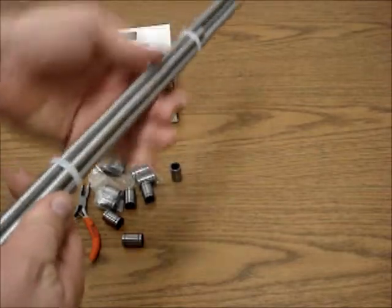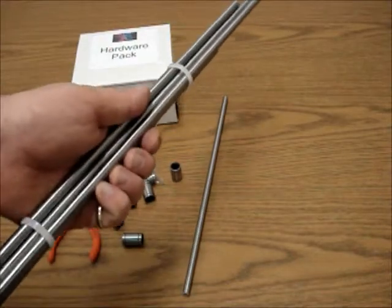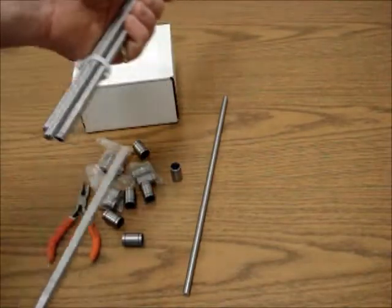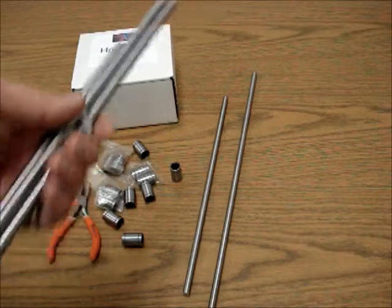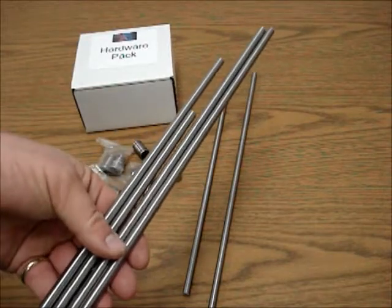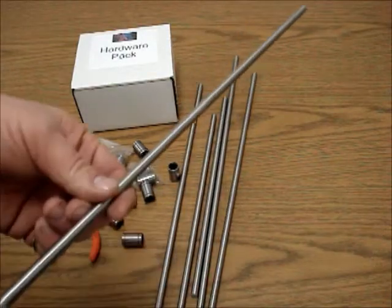We're going to slide these out and take each of the smooth rods. You can actually kind of hear them — they kind of sound a little bit like sandpaper as you're moving them out. Even though they call them smooth rods, I like what's called drill rod. Drill rod is extremely hard. It's through-hardened. It's a tool steel, so it's very, very hard stuff. It's also precision ground.